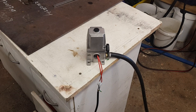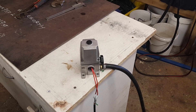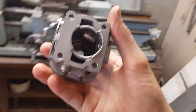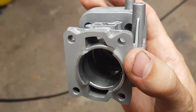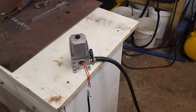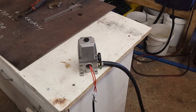I hope that addresses your query there Gary and I hope you'll keep watching. They really are a good machine, and being non-abrasive I'd suggest if you had some kind of aluminium bore like this one here without a sleeve, I don't know if I'd go too long on there — it doesn't need much. You can kind of see I just gave it a quick flick. If it's a soft bore like an aluminium bore on a small motor I'd probably recommend against doing too much blasting, but with harder metals like the insert that's in the solenoid I'd feel quite confident. Until I saw your query I hadn't even thought about testing it because I was just so confident it would have been all right. Hopefully that addresses that one.